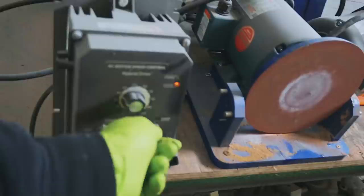I've got this thing flattened out. Now I haven't introduced you to this yet — this is our disc sander variable frequency drive. Why do we use this when we have a belt grinder? Well, the belt grinder doesn't like to make things extremely flat — it does a decent job, but with that belt spinning around, not super flat. The disc sander, however, that nice machine surface behind a very thin piece of sandpaper ensures we can get things much flatter. We can also get some very nice surface finishes. This is a 320 grit piece of wet and dry, and this is looking very beautiful.